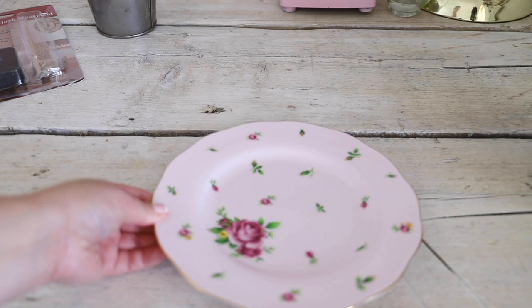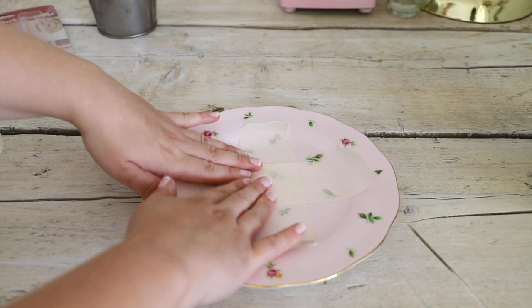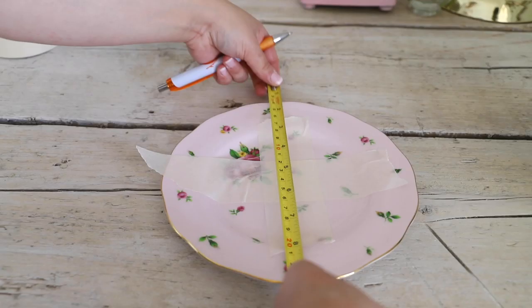When I was researching how to drill through porcelain, a lot of people taped the center or taped where they were going to drill. So I'm just adding some tape - I think it helps and prevents cracking. I then measured out and found the center and popped a dot to use as my guide.